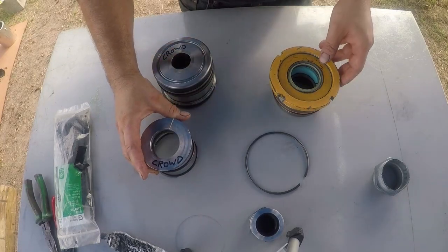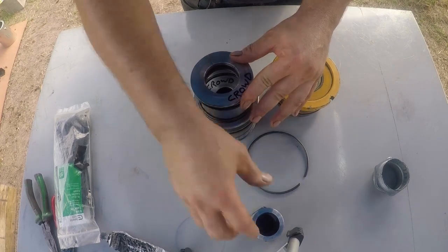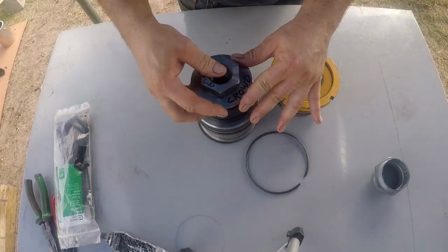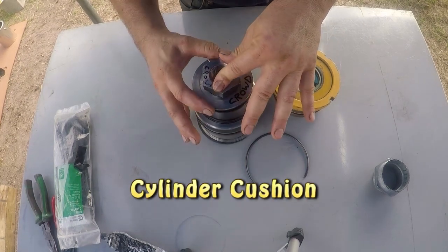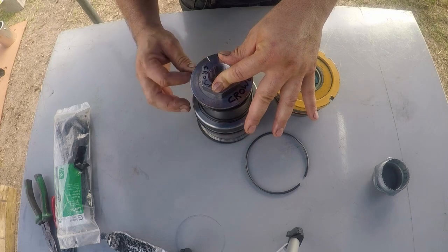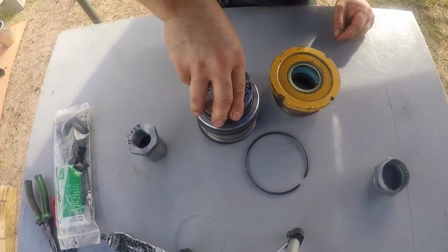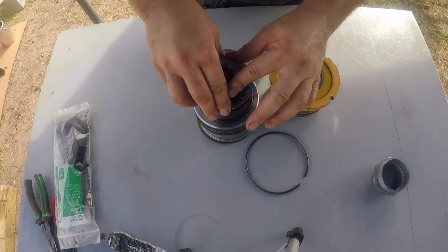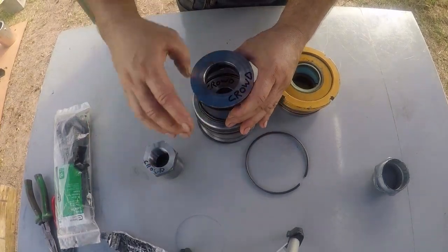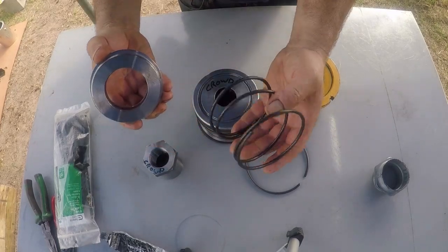This one over here is special. They have this contraption over here and the nut goes on the rod like this. The nut, spring and flange are called the hydraulic cylinder cushion. Their purpose is to decelerate the rod near the end of stroke. This is how it came out. The nut goes on the rod. And this has a guide inside. And this spring.